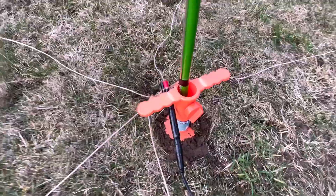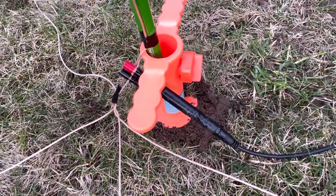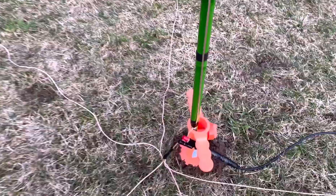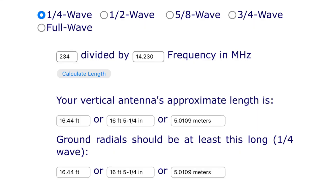If you're building this on land — in your backyard or at a park — use four or five counterpoise wires, about five meters or longer. The length doesn't really matter if they're on the ground. I know someone's going to say you need elevated radials, but listen, this is a simple antenna for beginners. Just put four or five, about 17 feet if you're American, on the negative side of the banana clip or the un-un. Up top, a quarter wavelength. There's a formula, and there's a great website with a calculator — I'll put a link to it.